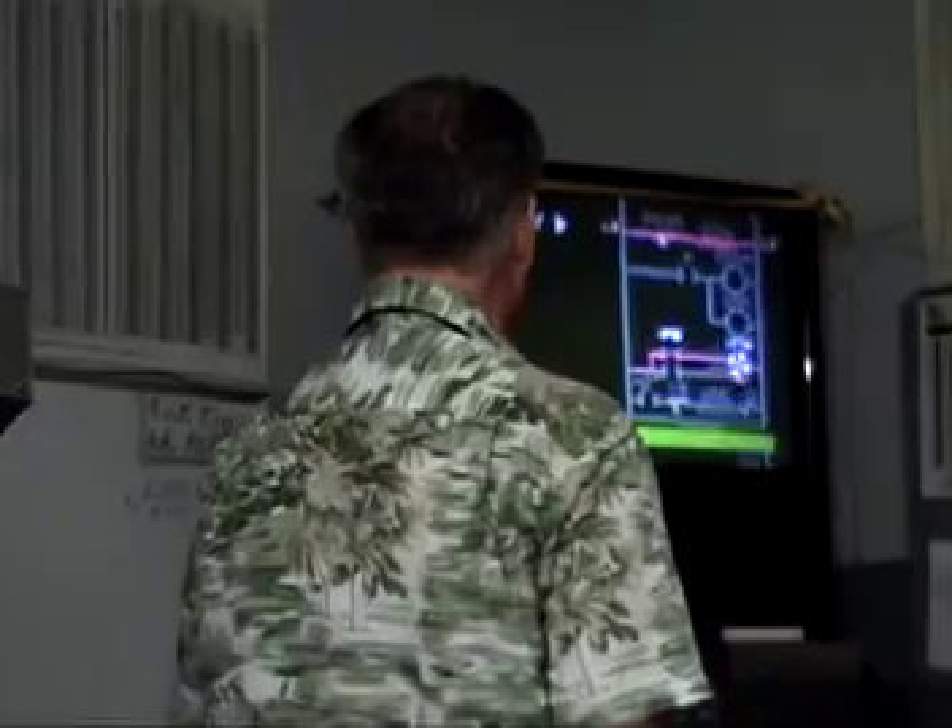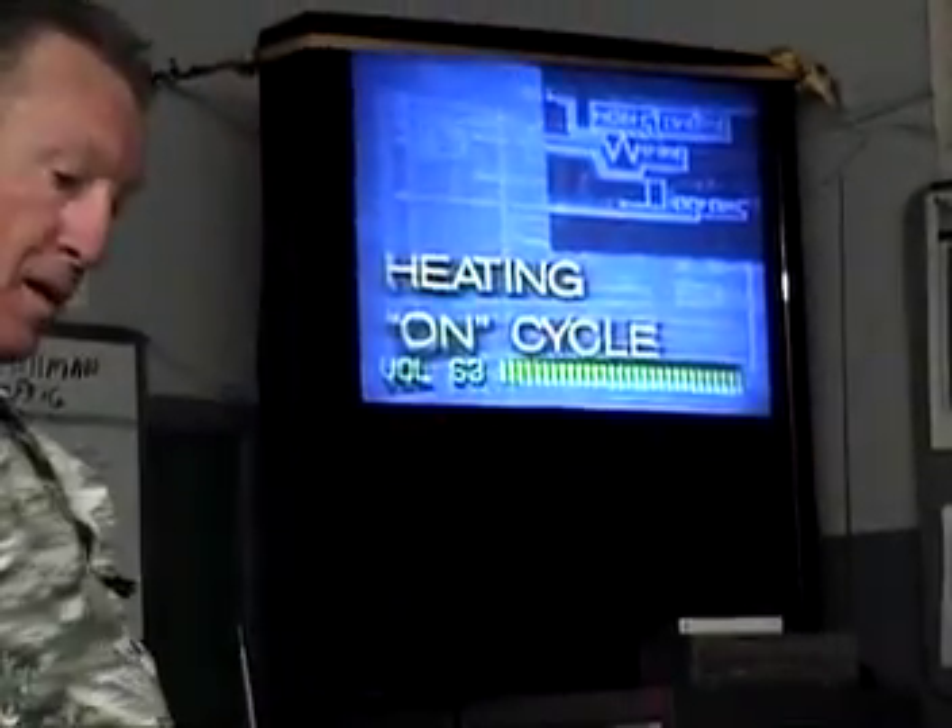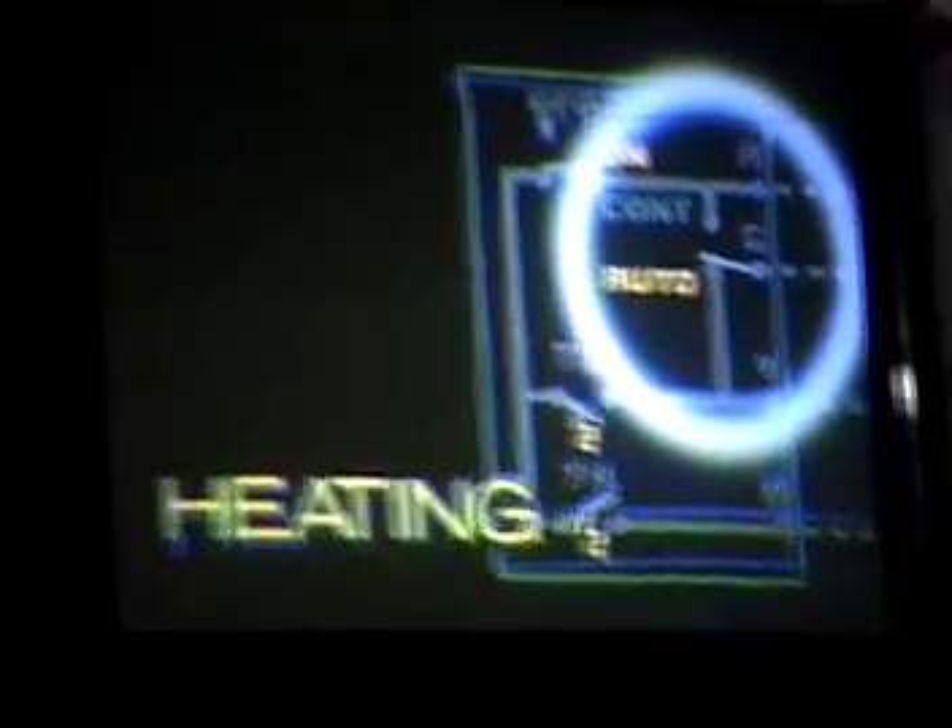Okay, so this is what we're going to go over right now. On this particular unit they have a little switch that clicks closed. During a heating cycle, when heating is required, the thermostat is set to the desired temperature and the fan switch will usually be on auto. On most systems, if you have it on auto, the fan relay is closed and electricity is flowing through it all the time — just waiting for either a time delay or a temperature signal.